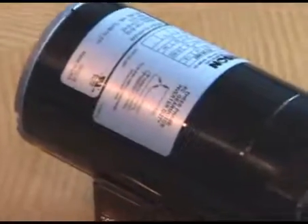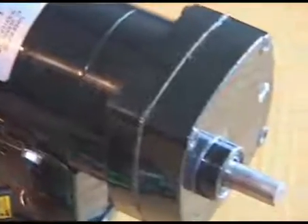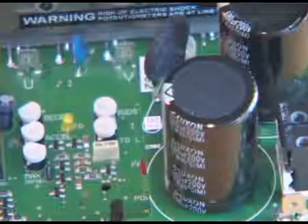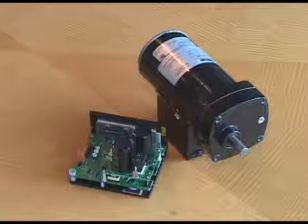Good speed regulation can be attained with the drives of one to three percent. Typical speed ranges are between five and nine to one. And there are no brushes to wear out, so from a maintenance standpoint there really is no maintenance — they'll run continuous duty at the full speed range. Thanks for visiting us at Bison Gear. You can check our website at BisonGear.com or give us a call at 800-AT-BISON. Thank you.